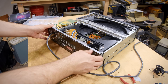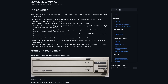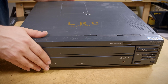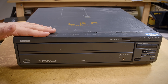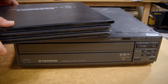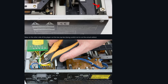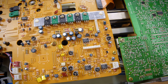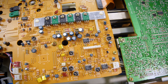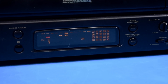Gaining access to this lower level signal from the disk is a bit tricky and is dependent on the model of Laserdisc player you're able to use for this. The Pioneer LDV4300D is the player that has been documented the most for use with the Doomsday Duplicator. For me, by sheer coincidence in May of 2018 while the project was still in beta and I knew nothing about it, I bought an LDV4400D that I essentially just put onto a shelf for the next five years. It came with the RLVs I have, and since I have that model and it is effectively identical to the 4300D, it made sense to use it for this project. The Doomsday Duplicator wiki page has specific steps for this model, but you can most likely do these not-too-invasive mods with the majority of Laserdisc players. The goal is to gain access to an RF test point header, which has the raw analog data exposed so you can capture it. Most players should have this — for example, the CLD V840 has an RF test point available on pin three of CN401.